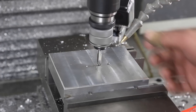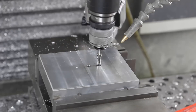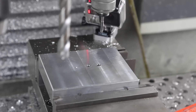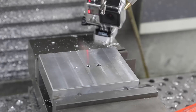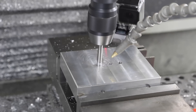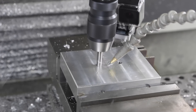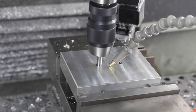A little tap in action — I love that. Now it's going to pull in our 5/16 drill to pre-drill for the 3/8-16 tap, and I'll show you how we're going to tap that — no secrets, just hand tap it with a guide. Do you guys care about the GoPro in the background? I'm curious if the footage is any good. I'd rather not have the GoPro in the shot, but if the footage is great maybe it's a trade-off — I'll see if I can locate it so it's a good picture but not in the way.